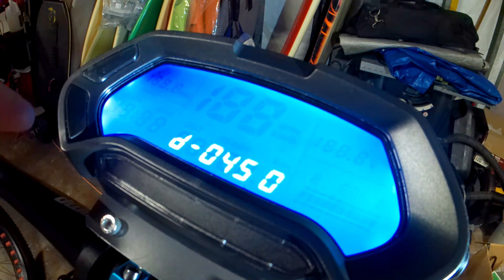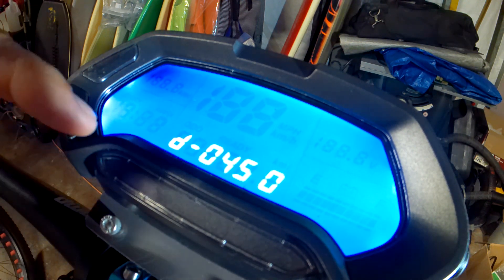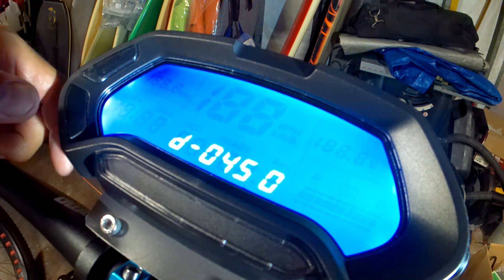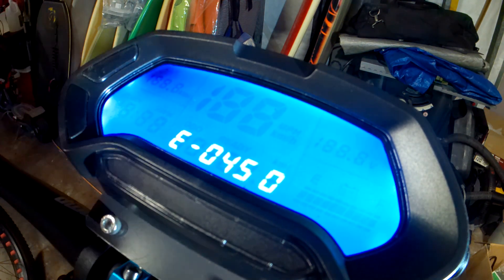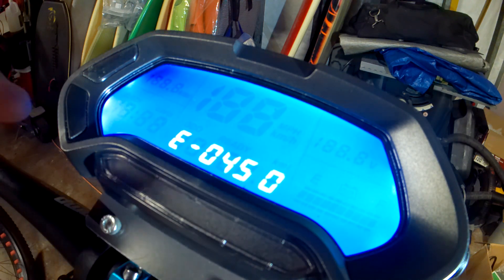Then you advance it to the D option. So D is your 0% voltage. My 0% would be 45 volts for my 15S because I'm setting my low at 3 volts per S. And then you want to set E at the exact same thing, so set for 45.